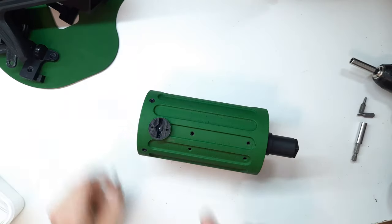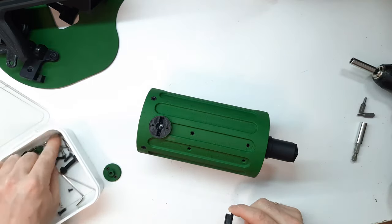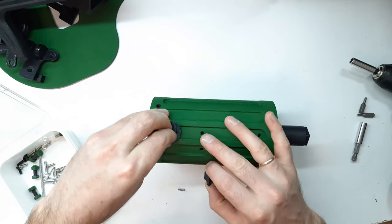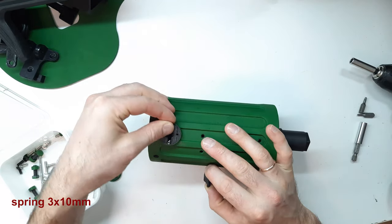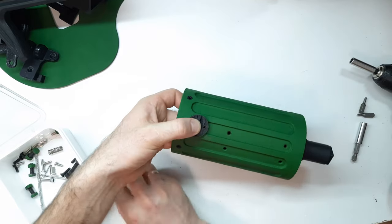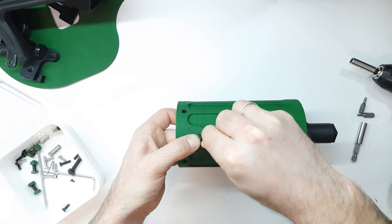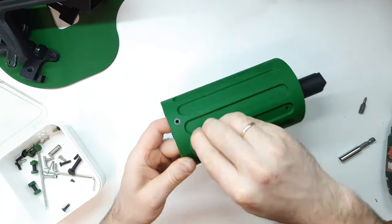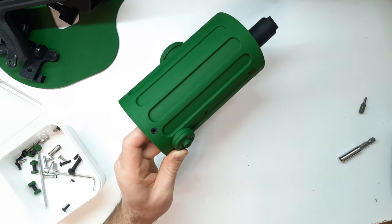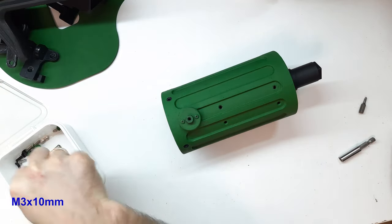In the lower part of the shroud there is a hole into which we will install the pistol stopper — part number three. This part is necessary to secure the pistol inside Max. We need to achieve free movement of the stopper in the slot of the hole, and also pre-install two small springs, size 3×10 mm, so that under certain conditions the pistol does not get jammed in the slots. We close this mechanism with a small cover, part number four, and fix it with ISO 7380 M3×8mm screws. Screw an M3×10mm screw into the center of the cover.